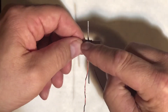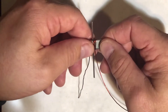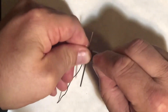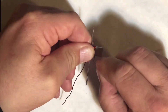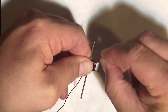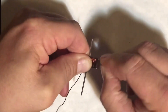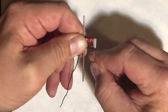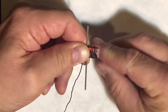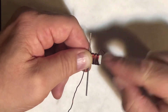I've got about three and three here, so I want to count — you can count anywhere from five to ten wraps on each side. We want to keep this as tight as possible. I'm going to wrap as neatly and as tightly as I can: one, two, three, four, five, six, seven, eight. Now here's the trick: if you wrap too tight now coming back to the center, it's going to squish in between and push all of your wire off the end. We don't want to do that.